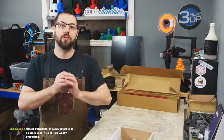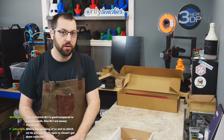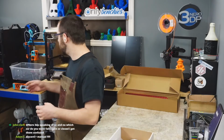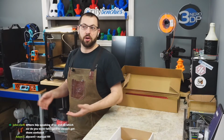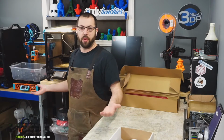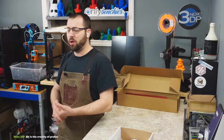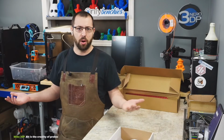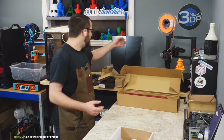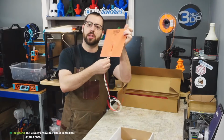And with the kits, we have no control over them, okay? So be aware, with these kits, we're seeing components swapped out from stuff we didn't spec. I'm seeing 80-tooth gears, like the 80-tooth gears in the V2s. They're throwing gears in there that don't fit in the printed parts. They're too big. They're not the spec gears. They're just some random 80-tooth gears they found. I'm seeing random motors in kits that have no specs with them at all. We can't find anything about them, and the serial number on them shows a 2011 manufacturing date. I've seen heater pads on some of these kits where the wires attached to the heater pads fall off.